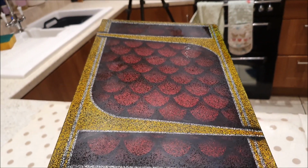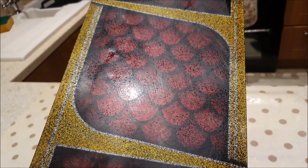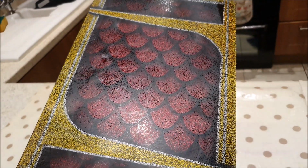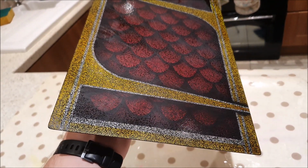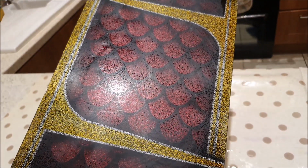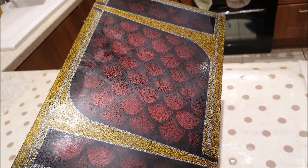See, what I'm looking for when I dry that off is, see those dark spots in the lacquer? They're the low bits that the wet and dry paper hasn't touched, so that's where it's still uneven. You see there's some on that edge close to my wrist. So that's what I'm looking for. I'm trying to get rid of as much of that as I can without going all the way through the lacquer.